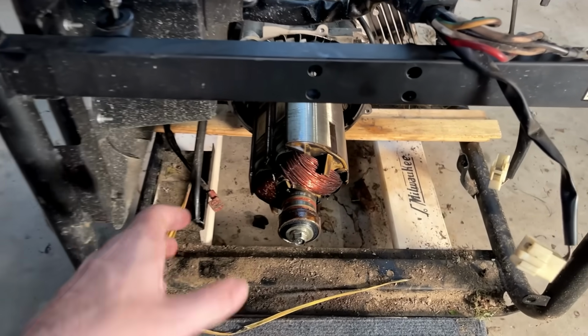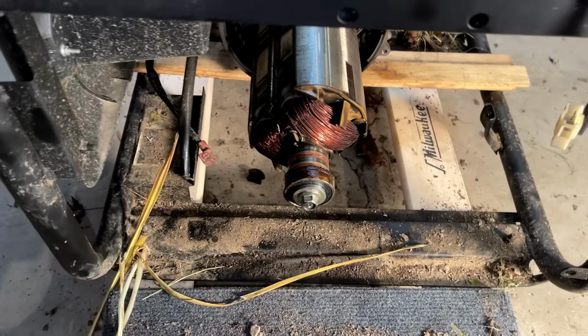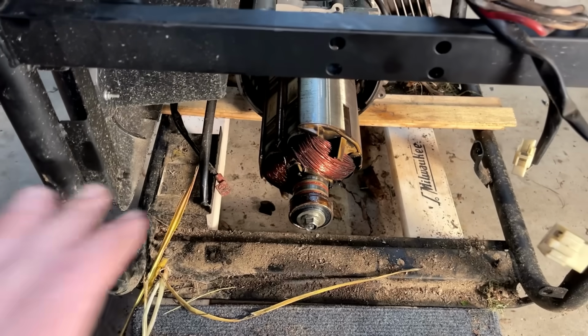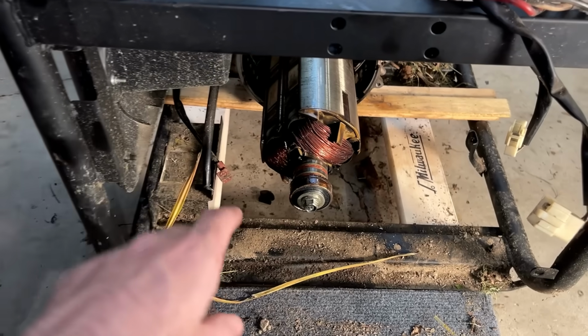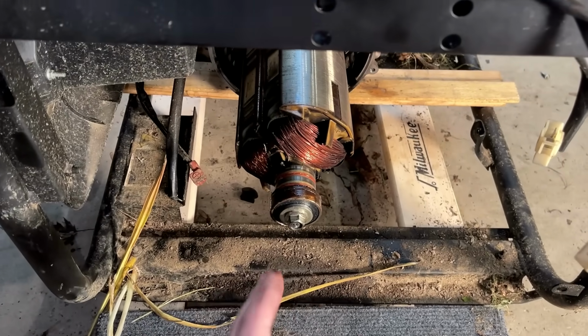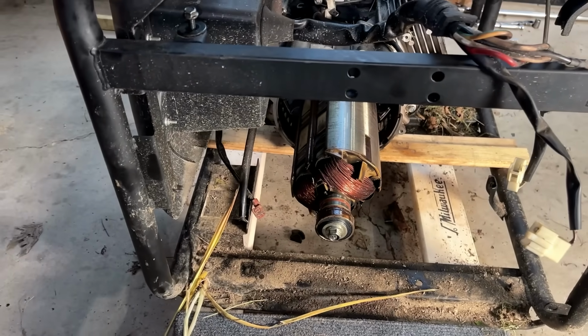So to get the rotor off, I'm just going to remove this bolt inside. It should be threaded with an M12 1.75, and I'm going to tilt the generator up, probably at about a 45-degree angle or a little more, and fill the shaft with water and put some Teflon on the bolt and build some hydraulic pressure and hopefully pop that rotor off.